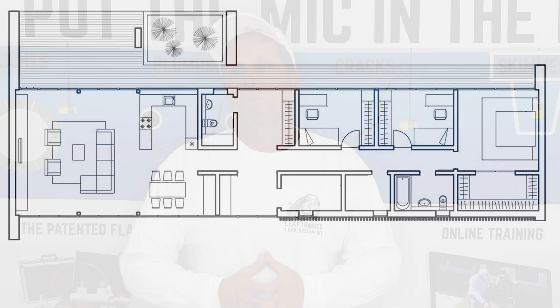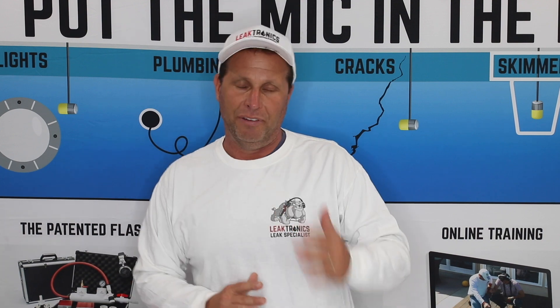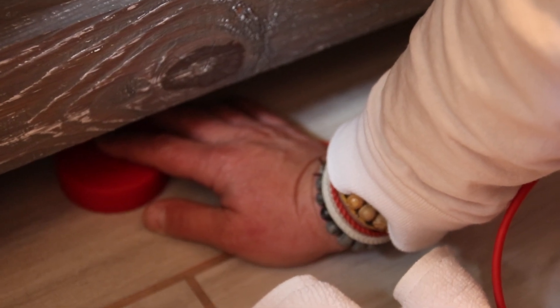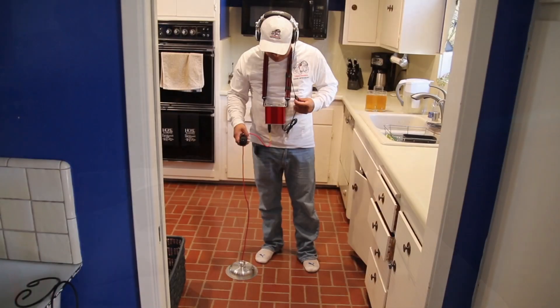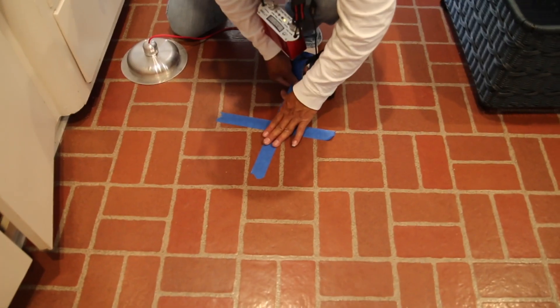So if you're in a bathroom, let's say it's on the cold water side, you always want to find another source — the next closest bathroom, an outside hose spigot or hose bib — anything you can use that's non-destructive, not a cut pipe. So if we're under a bathroom, we're going to be listening maybe with the soft sided listening disc underneath the sink, maybe with the deck plate near a vanity, wherever it might be, but we also have somebody else injecting air only from another source so we can get over the actual sound of the leak and mark the location.